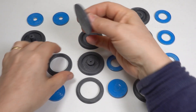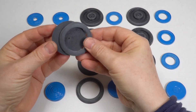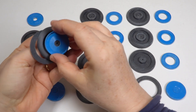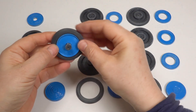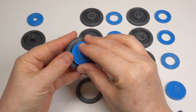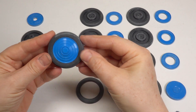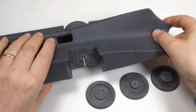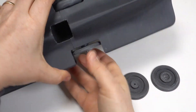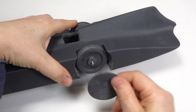And these are the parts that make up the wheels and tyres. Each tyre is in two halves and each wheel has an inner and outer face — that's four parts for each of the six wheels of Bluebird. The tyres were printed on my FDM printer in ABS and the wheels were printed on my resin printer, needing hardly any cleaning up. I'm using a length of M3 studding through the bodywork, stacking up the tyres in order and then securing them with a nut, which will then be covered by the outer wheel.